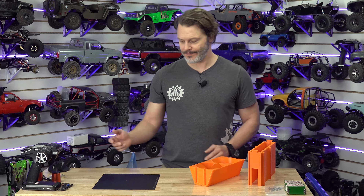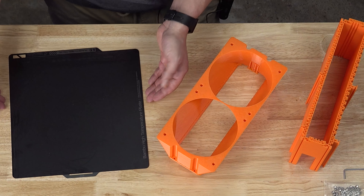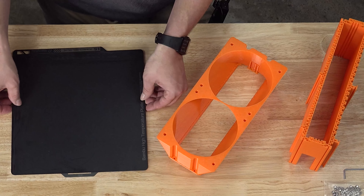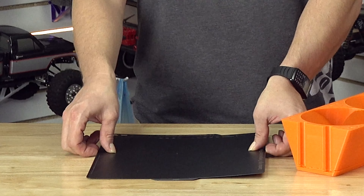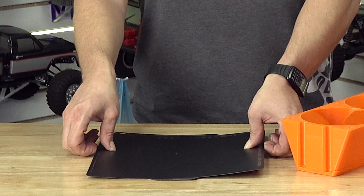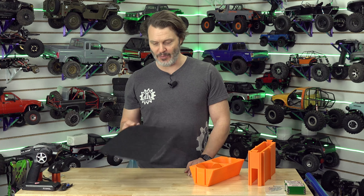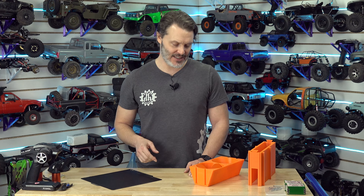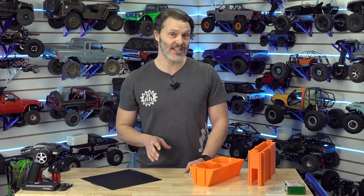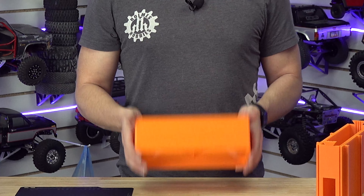Why is it doing it? The flexible build plate — that's the problem. I looked and watched: it's not curling off the build plate, it's actually peeling the build plate up sideways during the print. It's sticking very well, but the build plate being so flexible is the problem with the non-heated chamber. If I could heat the chamber up to 50–60°C, something closer to the glass transition temperature of the PETG I'm using, then we wouldn't have this problem.